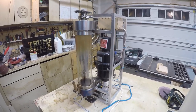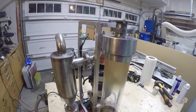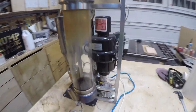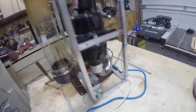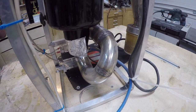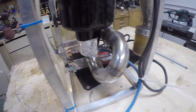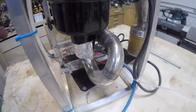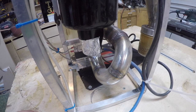I'll go through the decisions I made in building the roaster and some of the details. This roaster is based on a fluid-bed style build. The roasting chamber is all stainless steel and aluminum. The overall build has a blower motor in the middle — it blows through a stainless steel plenum that I fabricated. The piping is a little janky to fit, but it works well. These are stainless steel sanitary fittings in one-and-a-half inch from AliExpress, which is the source of most of the stainless fittings on the build.